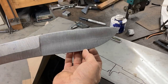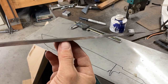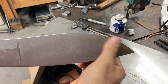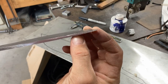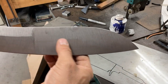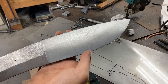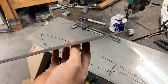Progress report. Nice clean flat bevel, edge to spine. You can see we didn't blow past our thickness on the spine — there is no bump here. We didn't blow past our thickness on our edge — there's just a tiny little bit of witness edge left there. The other side has been caught up, it is nice and flat too. We didn't get our tip too thin — ground the last inch or so from the top so we could see if we were preserving our distal taper, then we just blended everything nice and flat, no faceting. Most days with a little practice, if you hold your face right and eat your wheaties and don't neglect any of your major food groups and your heart is pure, you can totally grind something like this without any major dings.